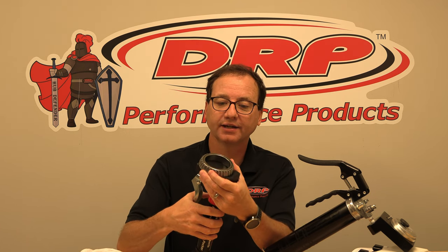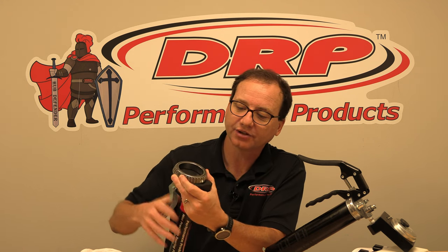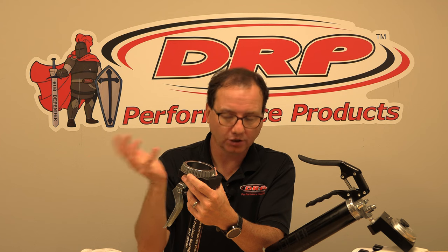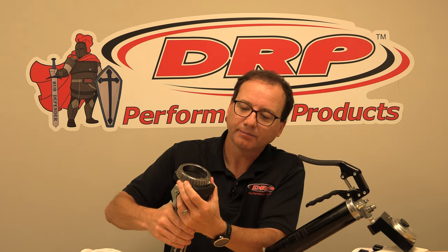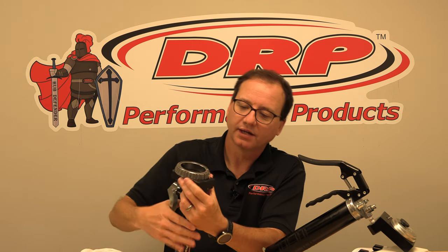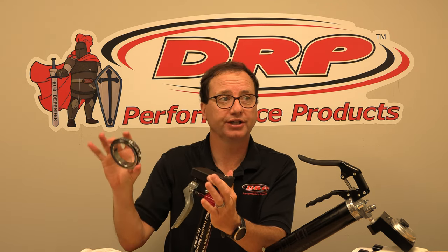On this one it is handheld, so it's designed for you to hold it in your hand, hold the bearing on it, and then just squeeze and inject the grease right in between the bearing rollers. Again we only pack the bearings 50% full — you can go a little less than that, but we normally recommend 50% full. That's just doing every other roller: pack one set of rollers, skip a roller, pack the next one, skip a roller, and pack the next one. You just go right around the bearing — it takes maybe a minute or so, and you get no grease on your hands.